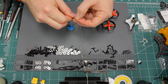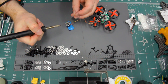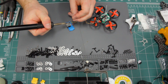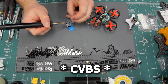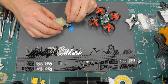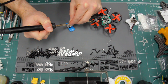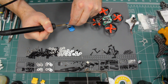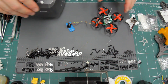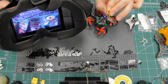Now I'm getting some flux to put on the soldering pad and the end of the wire, because flux will make the solder joint a lot stronger. I keep two sizes of solder at my desk; I typically use the larger size for everything, but this is such a small soldering pad and wire that I'm using the smaller solder. Now I'm tinning the really small CVBS soldering pad, then adding fresh flux to the wire — each time you solder, the old flux burns off and you need new flux for a strong joint. Now I'm soldering the wire onto the CVBS pad. And that's it — the camera works great.